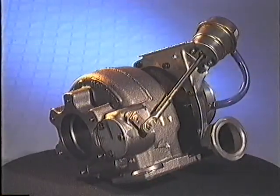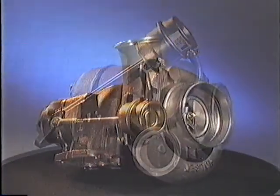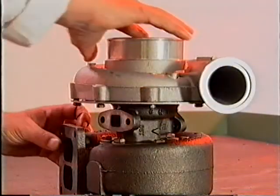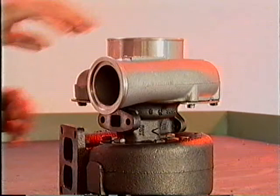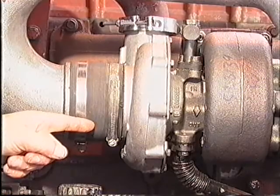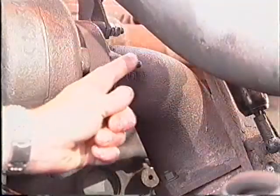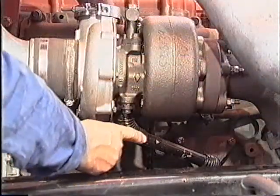If you have one of the Holset compressor-mounted wastegate turbochargers, it will be preset, ready for fitting to the engine. Any adjustment will affect performance of the turbocharger and will void the warranty. But other Holset turbochargers will need to be prepared before fixing to the engine. This is known as setting the orientation or attitude. The turbocharger must properly align with the compressor inlet pipe, compressor outlet pipe, exhaust manifold, exhaust outlet pipe, oil intake line, and oil drain tube.